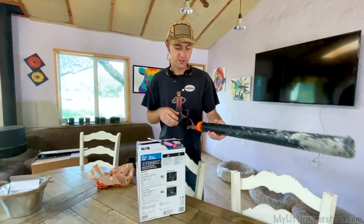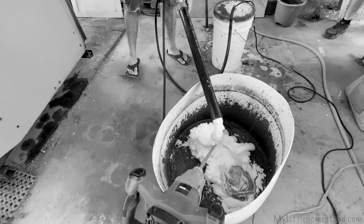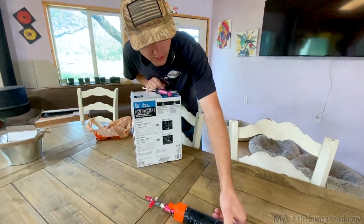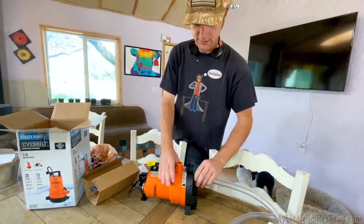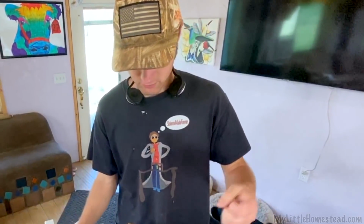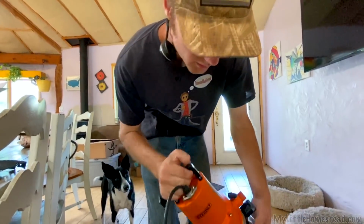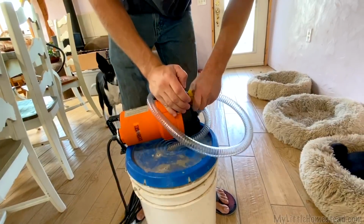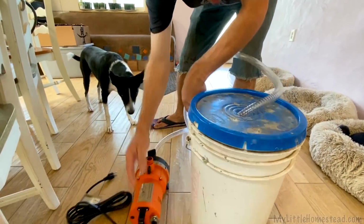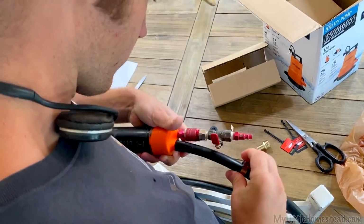Our beautiful foam maker needs an upgrade. So we need to upgrade the water pump. This guy is a much more powerful pump, hopefully, and will give us a little more oomph. It's a little bit bigger, but hopefully this will provide more power, because before I couldn't put in enough liquid per the air pressure, because there's actually back pressure from having the screen there. Water pressure wasn't enough to produce enough foam per second.